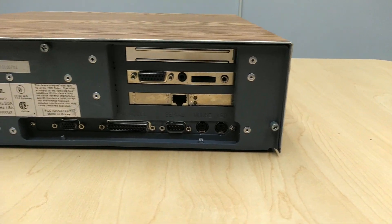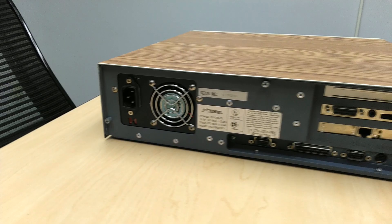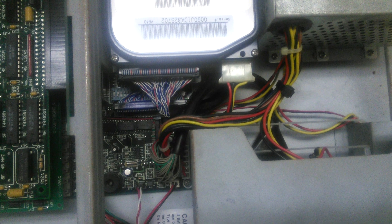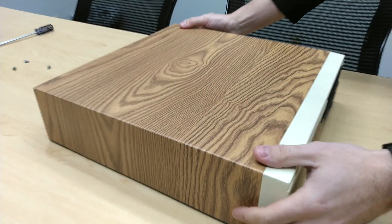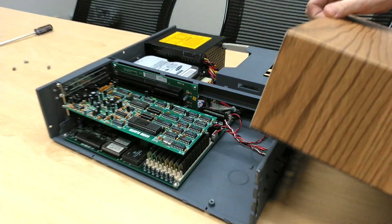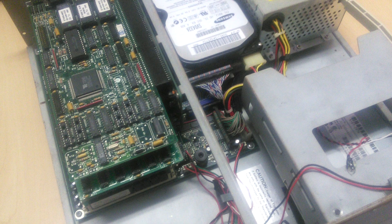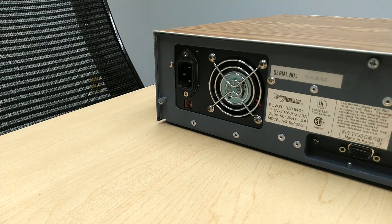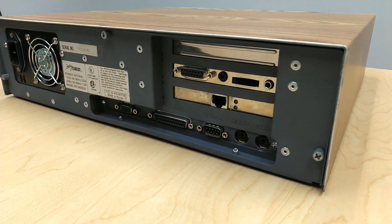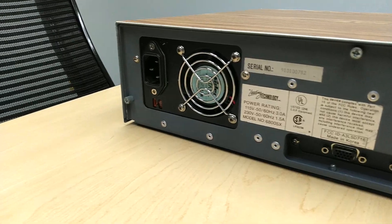It's made by a company I'd never heard of, Leading Technology. The model is a 6800SX, and the only info I was lucky enough to get was the manual, which was very helpful in figuring out jumper settings. Being a budget PC really isn't anything to brag about, but it actually makes the machine a lot easier to configure and use. It has an onboard IDE controller, onboard Western Digital Paradise VGA card, and thank goodness, PS/2 connectors — just having those ports makes it easy to use with relatively new keyboard and mouse hardware, instead of having to resort to yucky old serial mice.